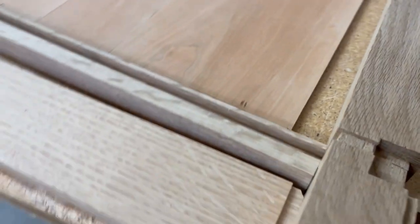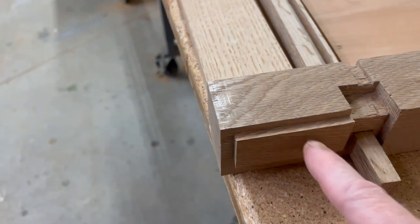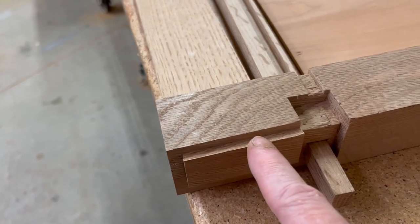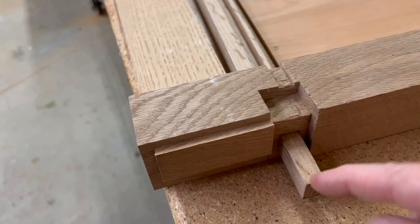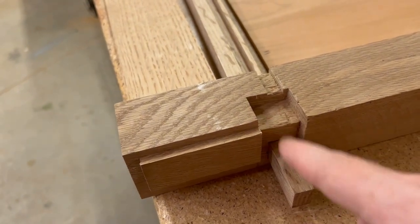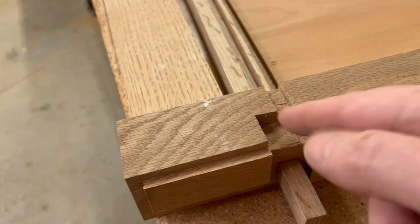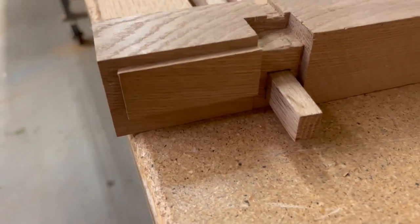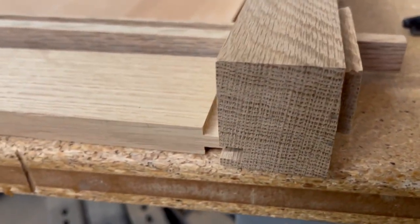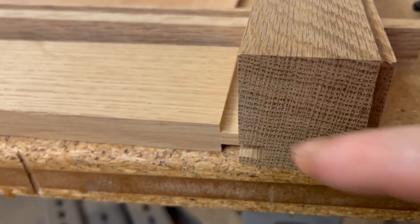Going around to the other side, you can see here, this is a dovetailed section, which the toe kick will slide onto. This long tenon will protrude through the front of the piece of furniture. And then there's also a sort of dado here and a cut out here for the base. So quite a lot of complicated joints to cut out of here on the bottom of this leg. I'm still going to chamfer these corners, so that still needs to happen.